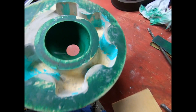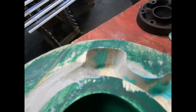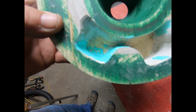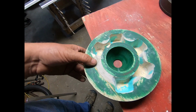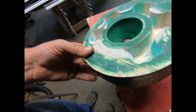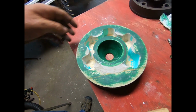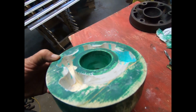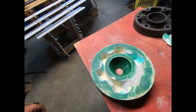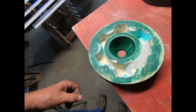Hey everybody, I've been frigging around with sandpaper and I'm doing a little spot putty now. Kind of hard to get it in there, but there's little tiny air pockets that was in that Bondo type stuff. So I'm just kind of filling that. I got to do it again. I didn't have a small enough tool to get in a radius. And I'll let that harden, sand it, and then I'll do it one more time. Then hopefully it'll be something the guy over at the foundry can use after I paint it. We'll find out.